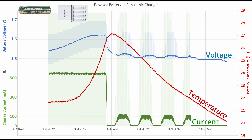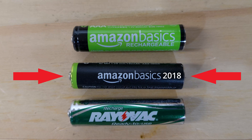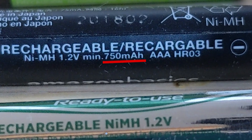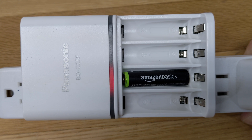So already it's not looking so great for the Rayovac charger, but it gets even worse. Remember how I have 3 sets of rechargeable batteries? I repeated this test with my Amazon Basics batteries from 2018. When I put one of those into the old Rayovac charger, it just never stopped charging. I'm not sure why this happened, because there was a huge voltage dip which should have triggered a stop. I let this go on for 10 hours before I just took the batteries out, at which time it was 46 degrees and had received 4,200mA of charge — over 5.5 times its rated capacity. When I put these batteries in the Panasonic charger, it actually wouldn't charge them and just gave an error code. I didn't realize it then, but the batteries were basically shot, and it correctly identified that.